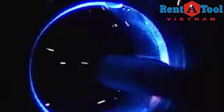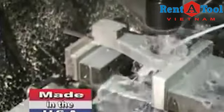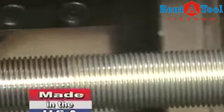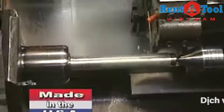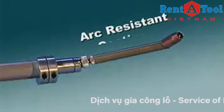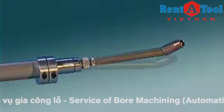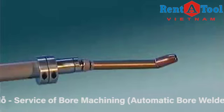The BOA 308i's fixed mechanical feed and the 450 HD's variable mechanical feed ensure accurate weld bead placement every time. Incoming voltage fluctuations have zero effect on bore repair system machines' feed rates. System components are machined to high tolerances with few moving parts. The BOA is an accurate and reliable addition to shops, mills, and plants. The BOA's torch body features an arc-resistant coating. The torch assembly includes a locking swivel mechanism. This feature allows the torch to be pivoted to reach the diameter to be welded.